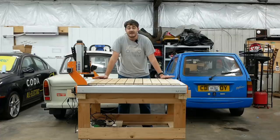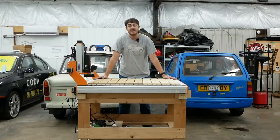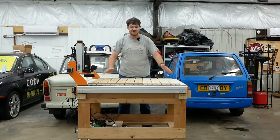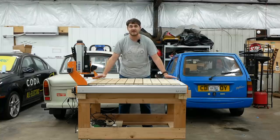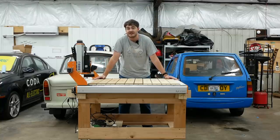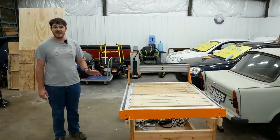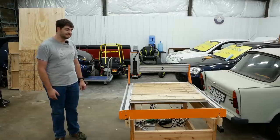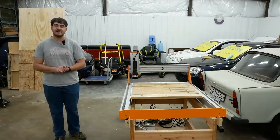Design considerations: if the sides of the table are going to be as long and wide as the machine itself, then the sides of the table will be larger than the work surface of the machine bed. So in order to cut them out on this router, I need to break down the sides into smaller pieces that interlock together. The M-Series has a wide open pass-through machine bed, so if you remove some of these slats, you can mill straight down through to the floor or whatever is underneath the router.